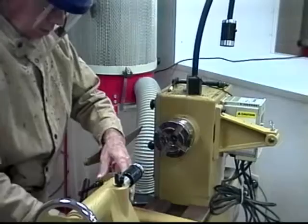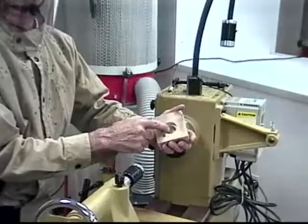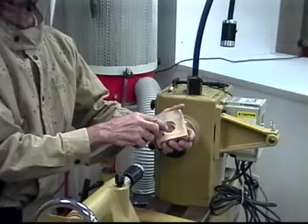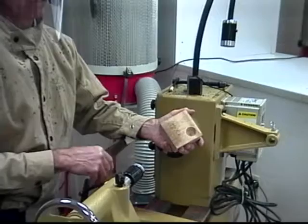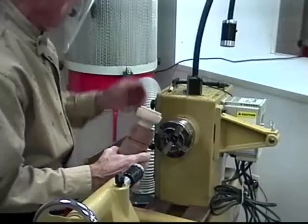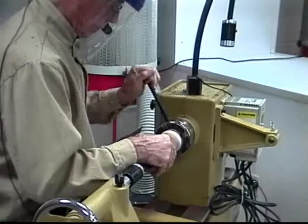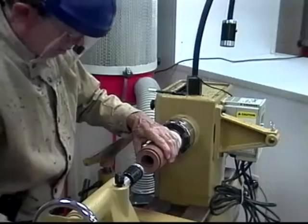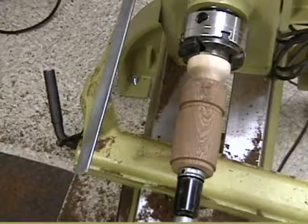And then to make that little jig, what I did is I took a block, drilled a 1.5 inch hole, and then I drilled 1/8 inch deeper so I could turn 1.5 inches and then drill 1 1/16 inches along with it. Otherwise you can't get past that 1.5 inches. And then I drilled another hole 1 1/16 inches to make that little tenon to start with. So it works. It worked pretty good. The jig came out where it fits snug. But the cone does work good going in the bottom, so that's a good thing.